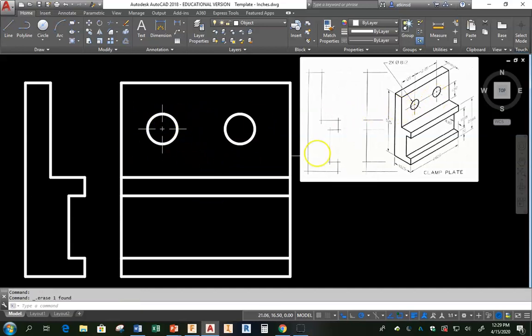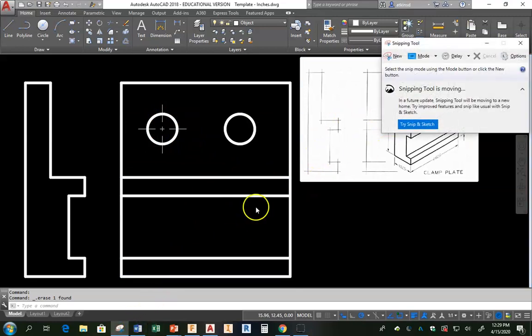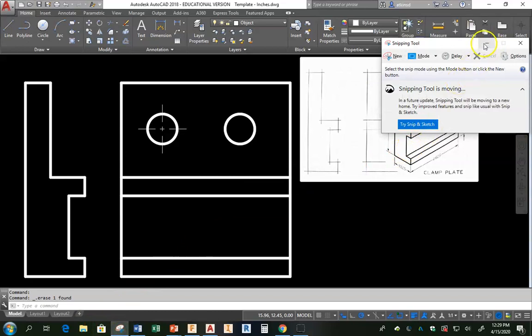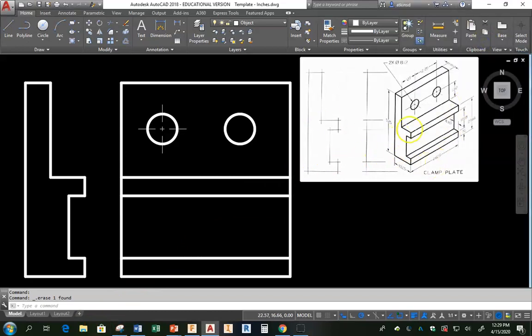The reason why they've got these center lines, I'll go back to our image. The reason why, whoops, I lost it by accident. The reason why I've got this center line going all the way through is because they want to show that they're in the same plane. Okay? So what I can do to do that is I can click, grab my grip, drag all the way over to here, grab it again, drag out, and say 0.25, and that will put it there.